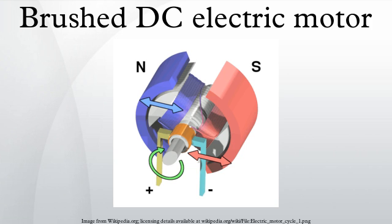There were 2 different classes of these rheostats, one used for starting only, and one for starting and speed regulation. The starting rheostat was less expensive, but had smaller resistance elements that would burn out if required to run a motor at a constant reduced speed. This starter includes a no-voltage magnetic holding feature, which causes the rheostat to spring to the off position if power is lost, so that the motor does not later attempt to restart in the full voltage position. It also has overcurrent protection that trips the lever to the off position if excessive current over a set amount is detected.